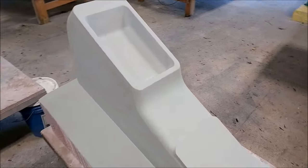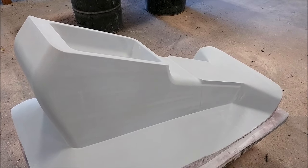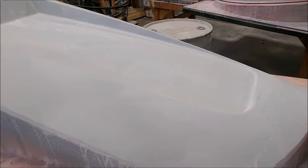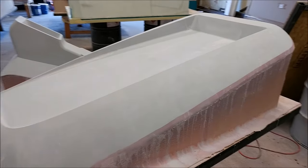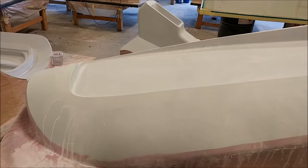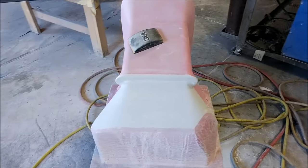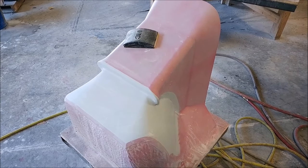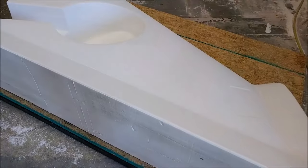Here's the center console — it's had two coats of primer and been all sanded, so now that one is ready for waxing. It won't be long before we're ready to pull a mold from that one. We've got a whole bunch of plugs now ready for molds. Here's the air intake tray after the first round of sanding after primer — it just needs another coat of primer and sanding, then ready for waxing. That's a quick one because it's mainly big flat surfaces. And here again is the center console stack after the first coat of primer and guide coat — it will still need another coat of primer after this round of sanding.